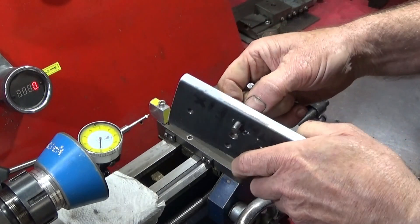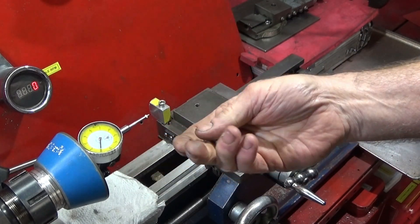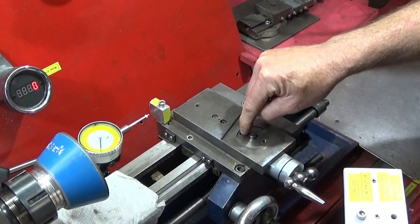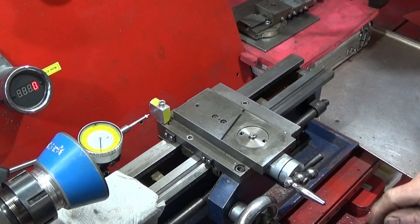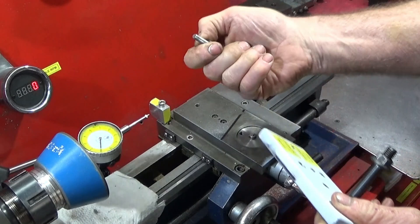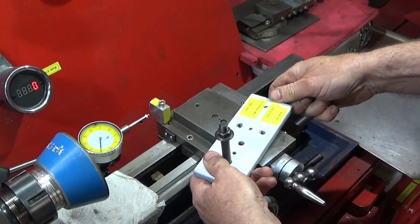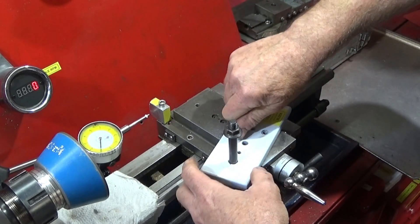The new screws for the 12 millimetre plate are 25 millimetre overall length. You need to check this when you're screwing something on to the cross slide because if you go too deep with the screws they can actually mark the inside of the cross slide when they bottom out. So these ones are 25 millimetre long including the head, as long as you don't put a socket in there for the head. So that one goes on there - put the screws in.